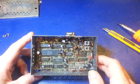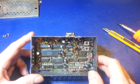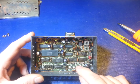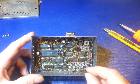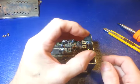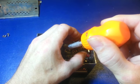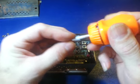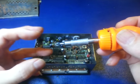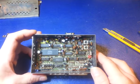And that problem is, I don't even want to really call it bad solder joints, because when you think of bad solder joints, you think of cold solder joints, which means the solder joint's fractured out around a component, and the solder itself is broken. So it's a bad connection in the solder. You've got the through hole, the component goes through it, it's filled with solder around that, but you have a fracture in the solder somewhere around the outside edge, but the solder's usually still stuck to the lead and still stuck to the trace. That's not the case with what I've been seeing on these.